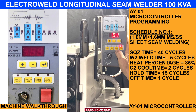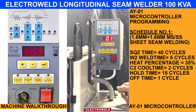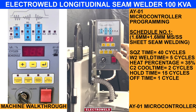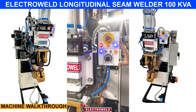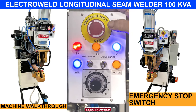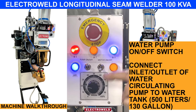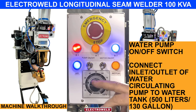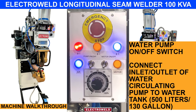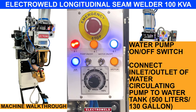This is a weld/no-weld switch — when you want to weld, put it on the weld side so you can try, or select no-weld. Here we have indicators: this is an emergency stop, then these are 3 phase indicators. This is the pump on-off switch. Before starting the machine, connect the pump inlet and outlet to the water supply and run the pump for about 5 minutes.